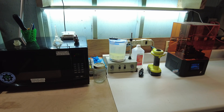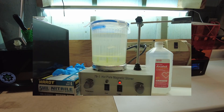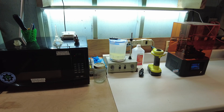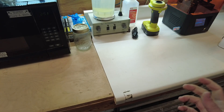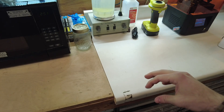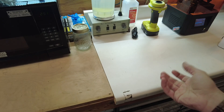With SLA printing, you have to first take the part off the printer and then rinse off any remaining resin using a wash of isopropanol or some other similar solvent. At which point, you can take the printed but not fully cured part and place it under a bright UV light to complete the curing process and make the part as hard as an injection molded part. The curing process is where things can get a little tricky — you want to expose the part evenly to UV light on all sides for usually about 20 to 30 minutes.